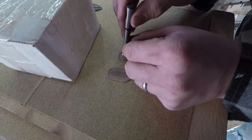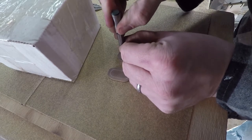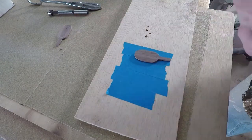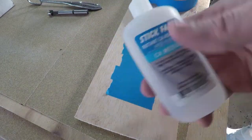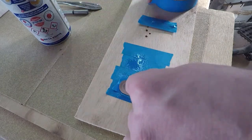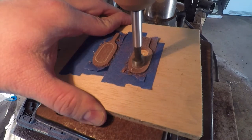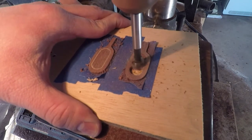I had to use a drill bit to make the head into a ring, and this was very scary — these were really fragile pieces. I ended up using a half-inch Forstner bit and decided to glue these really thin pieces down using double-sided tape, super glue, and activator to a waste board so I wouldn't get blowout on the back end. I was definitely holding my breath, but luckily I didn't have a single issue and they turned out pretty good.